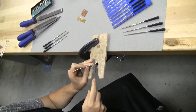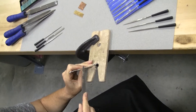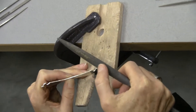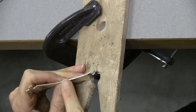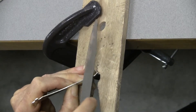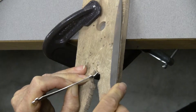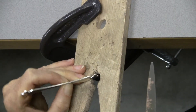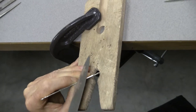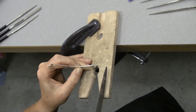I don't want you working in your lap or on the table. Please work on the V-board because it allows you the most control and the most support. If I am working on a curve, I'm going to choose a curved kind of file, especially for a concave curve. The longest filing stroke is the best. You're always filing away from yourself towards your solid surface, and I'm bracing this — the more pressure you can get into that file, the faster it will file down.